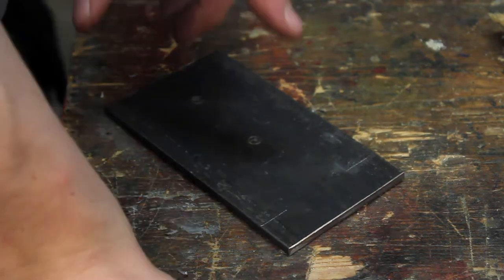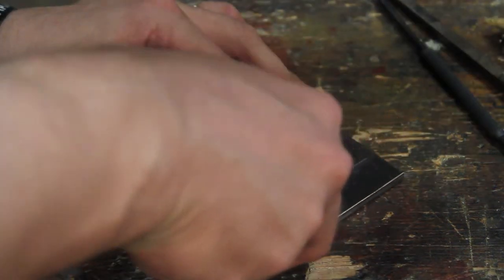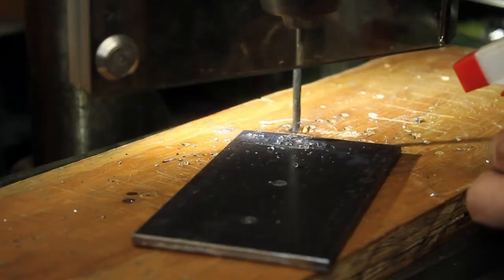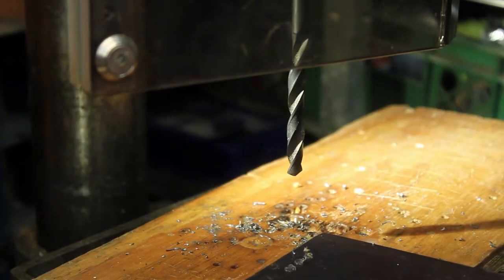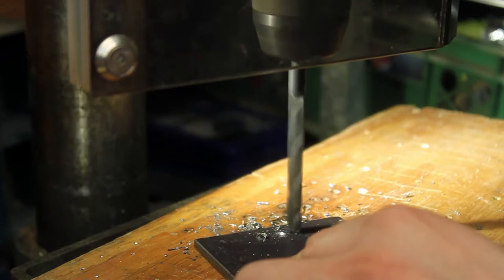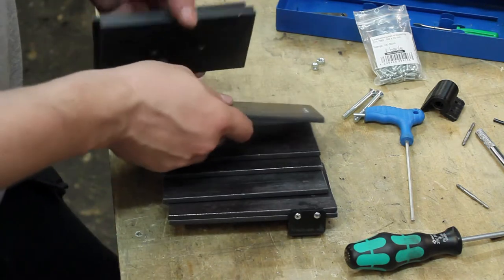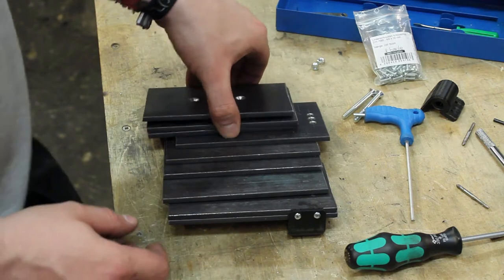Before I continue, I need to drill the hole where the line attaches — the line that goes over the pulley. These two other holes are there so I have some flexibility with the position to attach the line. Obviously I need to deburr these really well so as not to hurt the line that goes through. So the counterweight consists of these nine parts. The one to hook up the line to goes on the fourth position counted from the back — so three normal ones, then the one that sticks out on top with the holes, and then the other five. Let's assemble this.